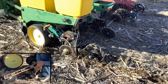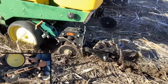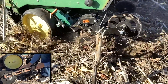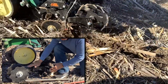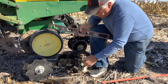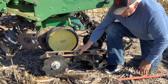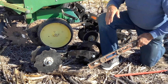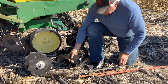If I go down with this wheel it's going to make it run off level, and what will happen is it will nose over on the front and cause a lot of problems — it's not going to compact very well. So when you get to the field, make sure this whole unit comes up and down so it's fairly level when running in the field. We're going to run probably about an inch to inch-and-a-half deep with those covering discs.